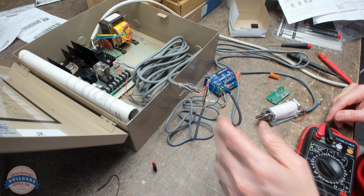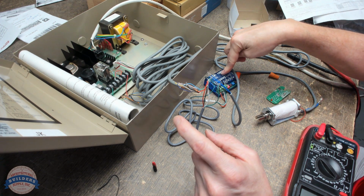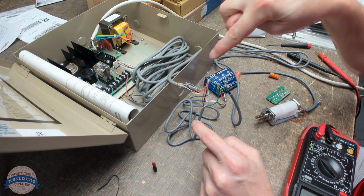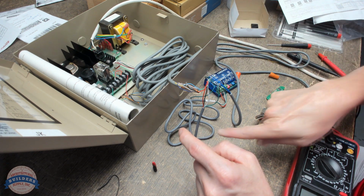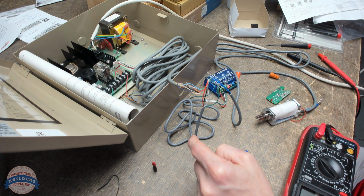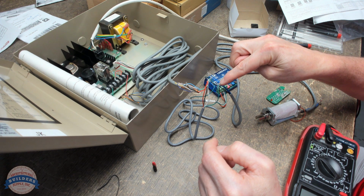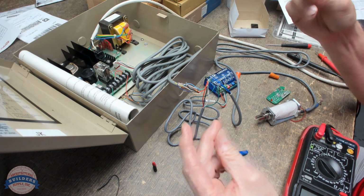The important part of all of this was, let's go through it one more time. We are powering the relay. We have power coming off of the outputs from the power supply going to our red and our black. The red and the black go through this wire to the red and the black down here. Then, chopping this tree down easily, take one of the two power legs from the load and wire it to the incoming power from the power supply. That's easy.